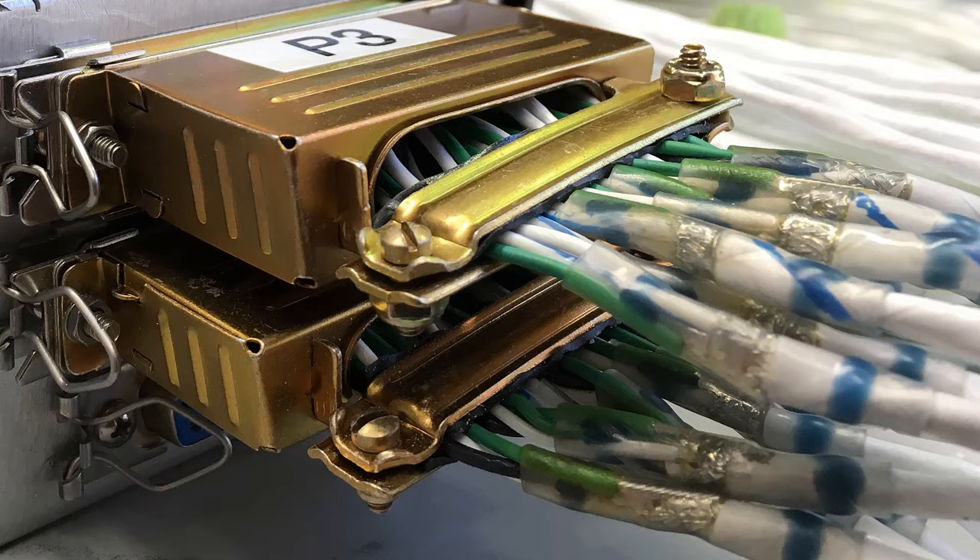I think these are viable options. I'm using them on the helicopter I'm working on at the moment — this is the first time I've used this type on a helicycle, and it's not close to flying yet. What I've done is ensured that no critical wiring goes through these connectors. So even if every D-sub were to fall off in flight, the engine will continue to run. I'd lose all the lighting, instrumentation, and everything else, but the engine would keep running.